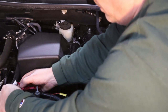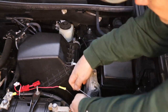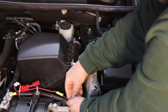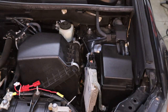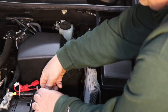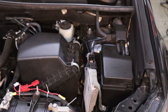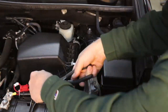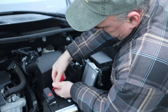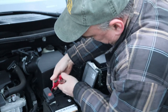This is actually still not live because there's no fuse in here, so it's really not powered yet. We're going to zip tie all of that, keep it out of the way, put it over on this side. That looks pretty good. I'm going to temporarily put this 30 amp fuse in just to test it until I can get the 10 amp fuse.